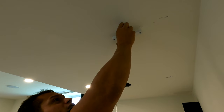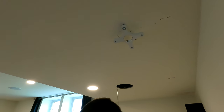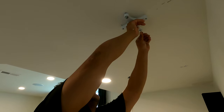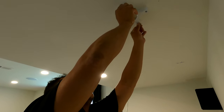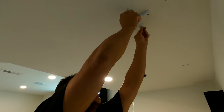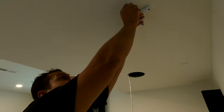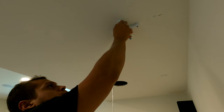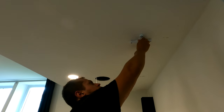This is the prerequisite for getting our wire runs done here. We can't begin to wire up the projector until we have the mount in place. Unless we have a mount in place with a mounting solution, we don't know where our gang is going to be cut out for the low and high voltage circuits the projector needs. So we can hand drive these, I guess, because we didn't prepare and get a hand driver. We'll hand drive these. We'll get her in position there.